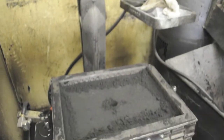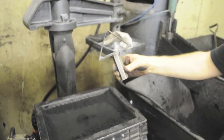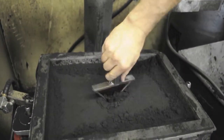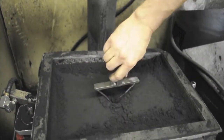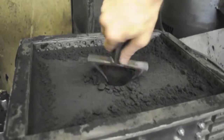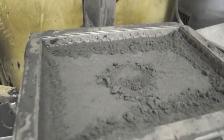Okay, so now we've got our sprue cut all the way to the bottom. Now we'll take this tool — this is a pouring cup cutter. Basically, we're just making a little bit of a funnel-shaped hole right at the top. You want to go about halfway up the sides of the triangle to give yourself a nice little funnel that's easier to pour the metal into.